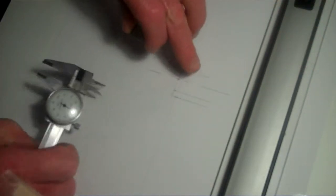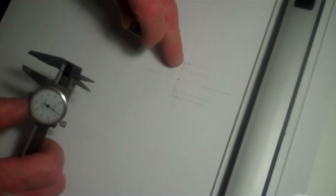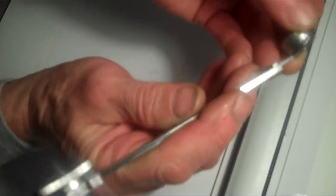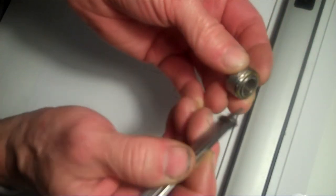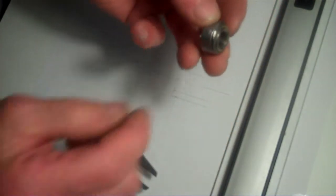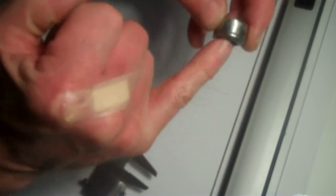And I have another diameter below this yet. Now this is the top of the flange here. That's the bottom of the flange. I could go below this now. The distance of this here offset from where this broken flange starts and where this part here ends. So what I'll have to do is get this from here down to here, get that thickness, and that's how much that protrudes down. And that part sits on top of the bearing that's on the motor shaft.